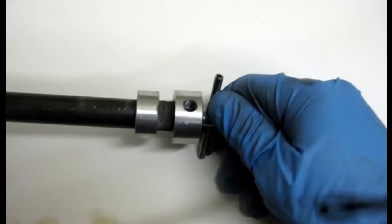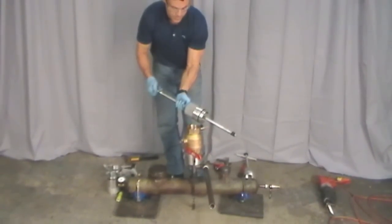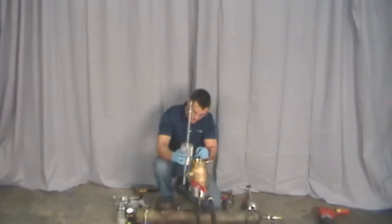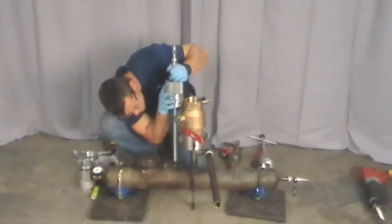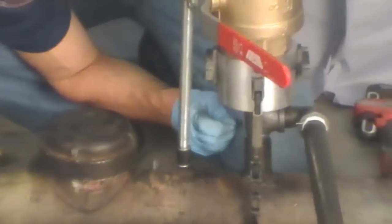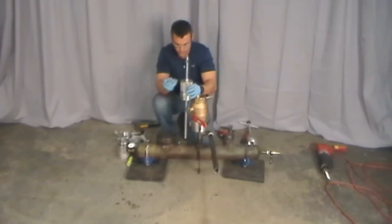Next, gently turn the small T-handle clockwise until you hear it click. This indicates that the small pin inside the shaft fully engages the dimple on the expander plug and will expand the plug when turning the small T-handle clockwise. Now, measure the travel needed to expand the expander plug into the throat of the T by lining up the lip edge of the expansion plug insertion removal assembly with the lip edge of the ball valve. Push to extend the shaft so the top washer of the expander plug lines up below the surface branch. Make sure to keep the shaft straight. Tighten the collar on the shaft to reference the necessary travel.